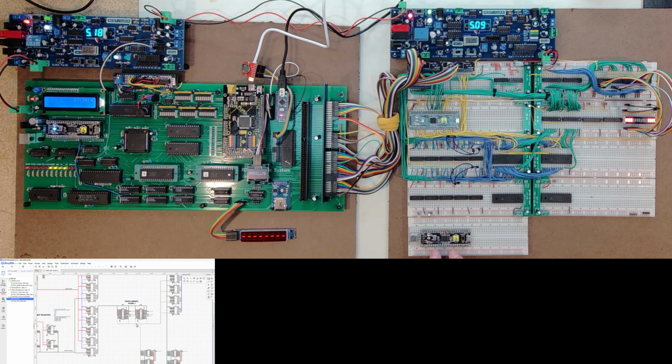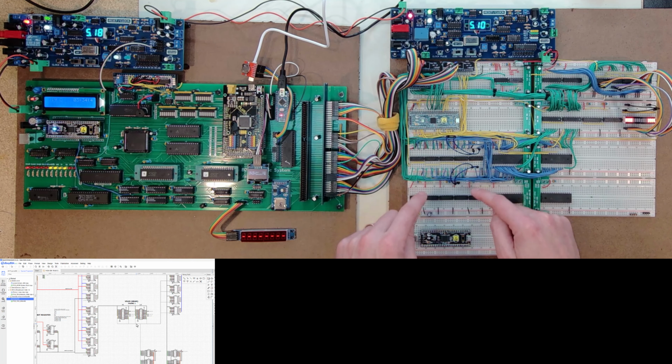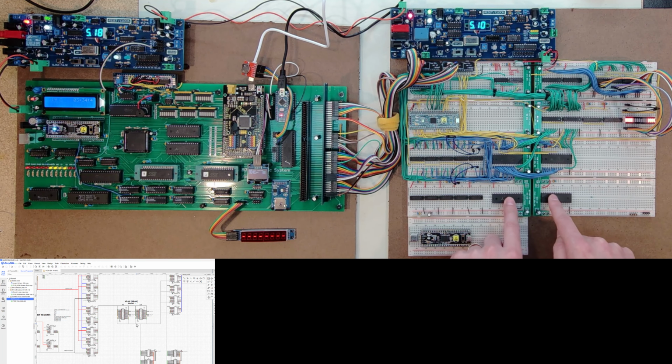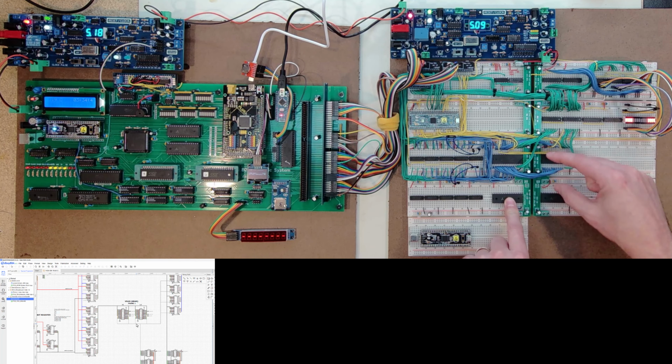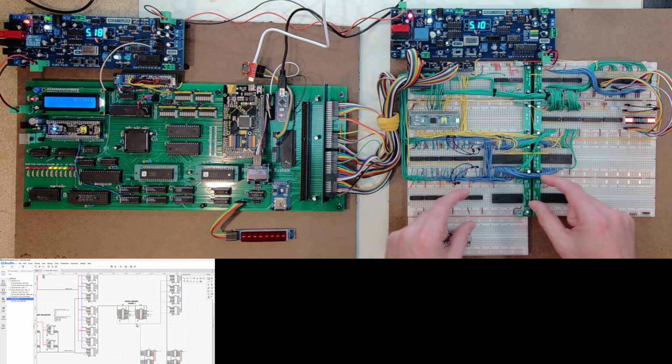Now remember, in a later video, I have to get all my addressing coming from my VGA output, and that's going to have to plug into all of these, and then I'll hop them up to here. But for now, I'm just looking at the addressing coming from my 286. So I'll get all of these lines brought over here. I'll bring all of this over to these two, just like you see up here. And these pair go to this pair of transceivers. These are now going to go to this pair of transceivers. And then I can just connect them right into these same data lines. So I'll just hop all of those over. So I shouldn't have any seriously long runs here anywhere. I'm just jumping off of things that I kind of already have pretty close and have done the hardest work. The rest of this stuff for frame 1 should be pretty easy to connect up.